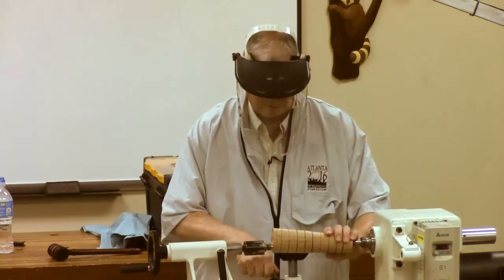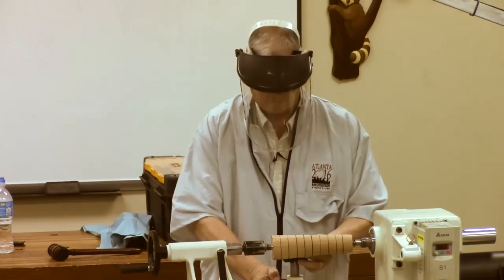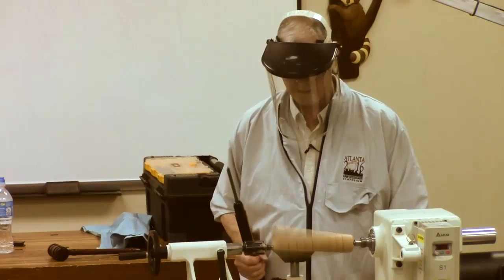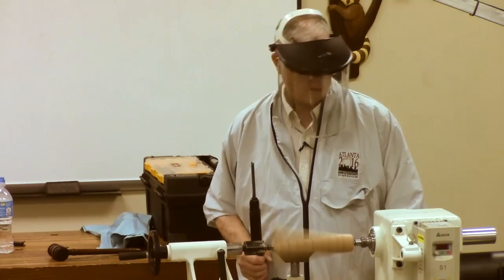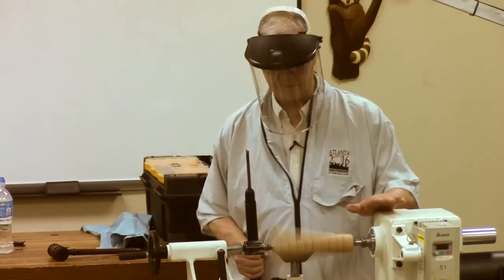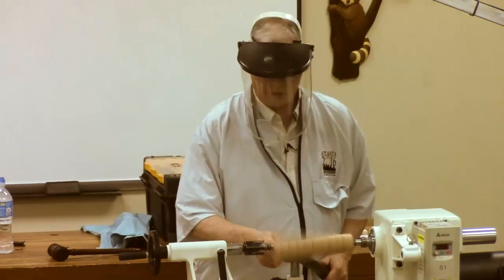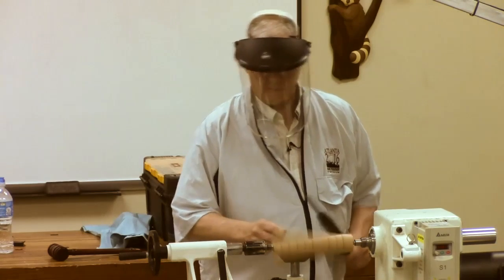To check this and make sure that it's going to pass the tool rest, make an adjustment. Spin it a few times - we're all good to go, nice and tight. Bring it up to speed. I'm running about a little over 700 RPM, and the lathe headbox gives a shake so that's fast enough. Now, the shadow I'm talking about - if I cut this I need to know where I'm looking. I can see the shadow right there.